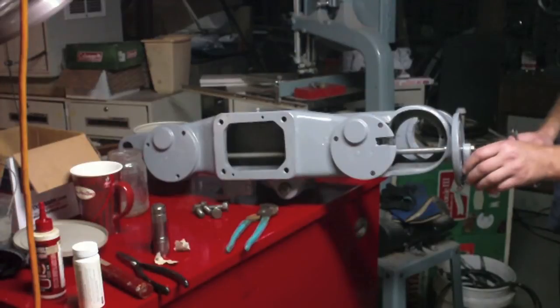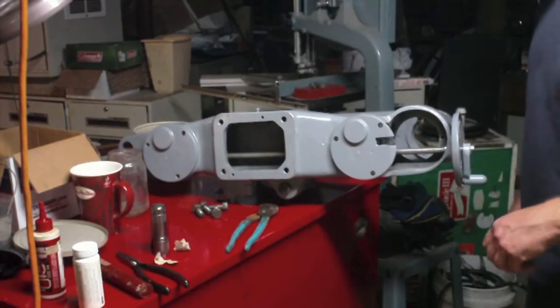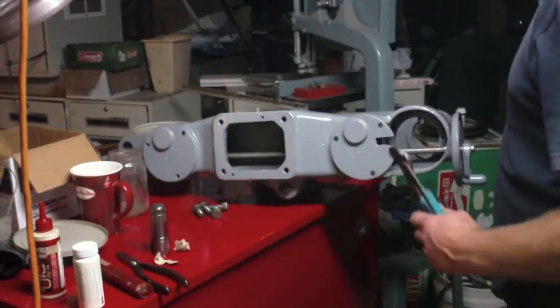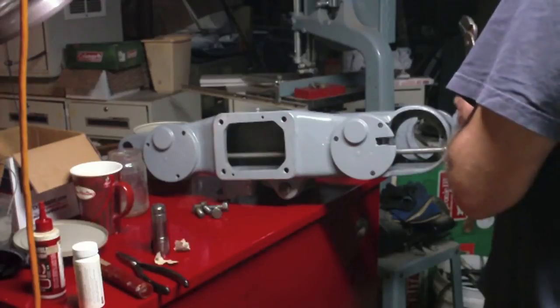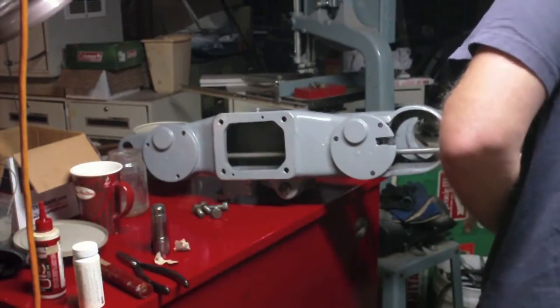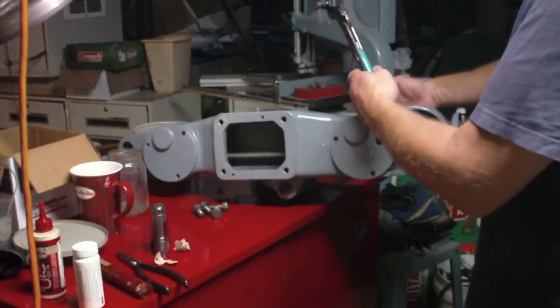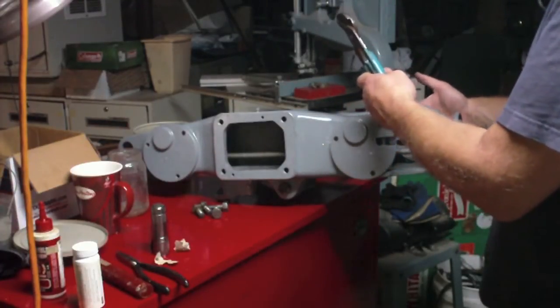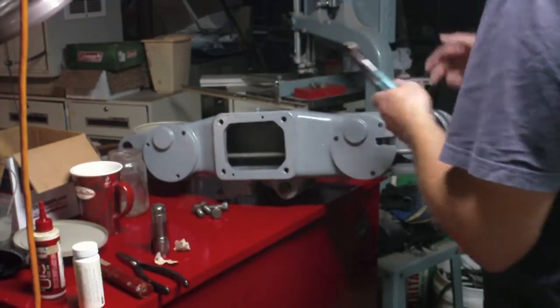Shouldn't matter where I put this lever, for now anyways, because the synchronization and the aligning up, so that when I put it on 1/2 inch it's the highest speed, and when I put it on 1/8 inch it's at the lowest speed, that all has to do with the position of where I'm going to have those sheaves, or those belt shippers, riding on those posts, which I can adjust later.